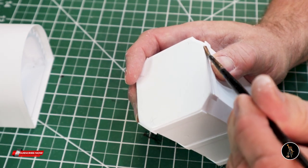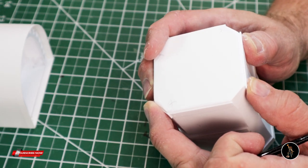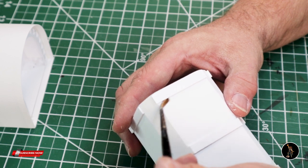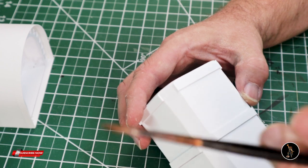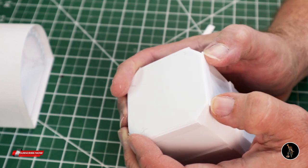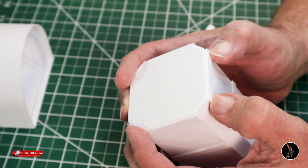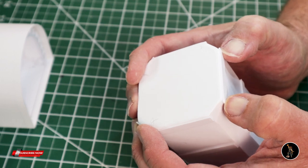Get my weld on, do an initial cover, make sure you press it down, especially on the ends, to where you're holding it down. You may see a little bit of the plastic squish out between the two plastics, but that's okay. Then once that's a little bit set up, just kind of come back with more weld on, especially on the ends right down here, on both sides. And then once I get that in there, what I want to really do is make sure I press it down on both sides to where it's really adhered, because I should have put a brace in the center of this container so it's not a slope, but you can tell that there's curvature in the container. So because of that, the angles aren't true. So I just need to make sure I really press these down.